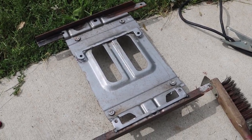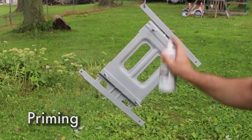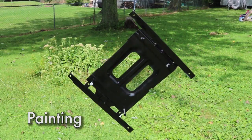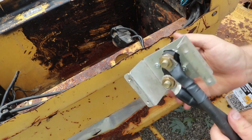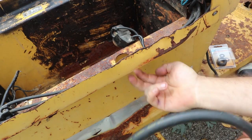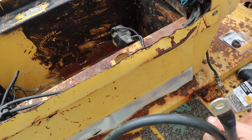There we go — that's what the completed battery plate and mounting points for the controller looks like. Now I should paint it. Here I have an old power disconnect. It's just a key and a plunger that activates a big oversized switch. I already put two heavy-duty cables on here and this is gonna be mounted down low, and the power cords are gonna come up through this hole where it'll connect to everything else. That's just bare metal edge, so I've got a grommet that I'm gonna cut and use to cover the edge of that.